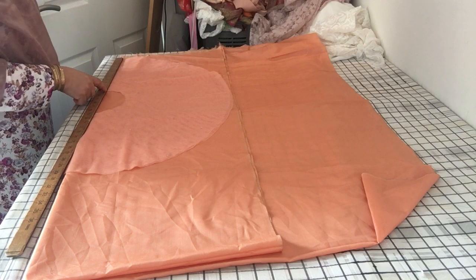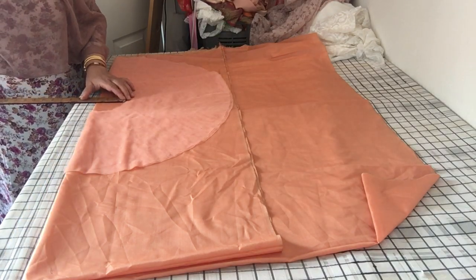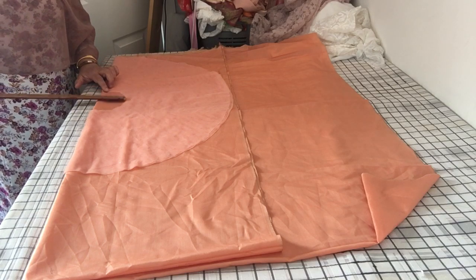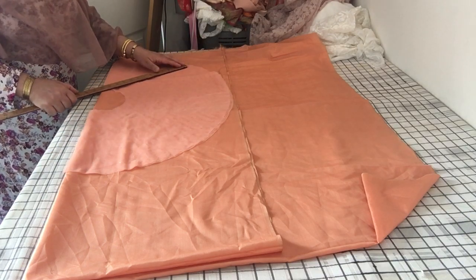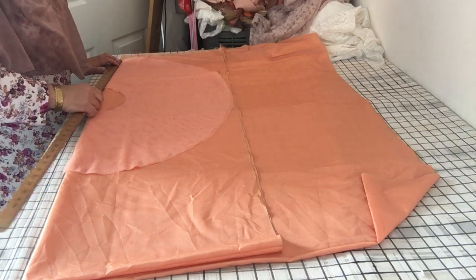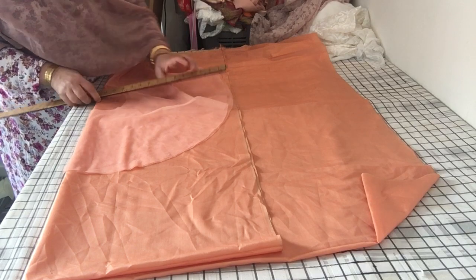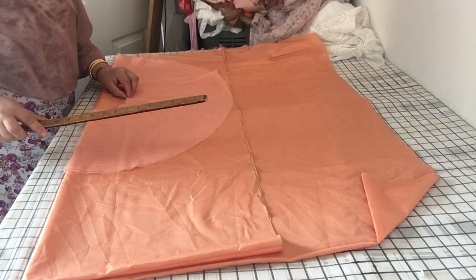The whole total of this is 36, so there's just a little bit over six inches in there. Mark exactly the same on that side — just slightly over three inches — and make sure the semicircle on the inside is exactly the same, and the full width on the outside is exactly the same. Before you mark the circle out, mark the outer side first. If the center is 15 inches, place the ruler and make sure you're going 15 inches all the way around until you've covered the whole circle.